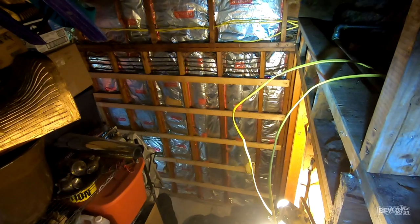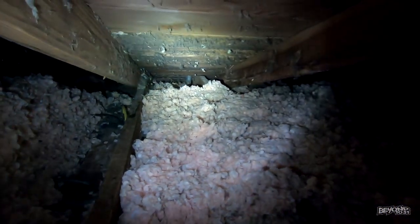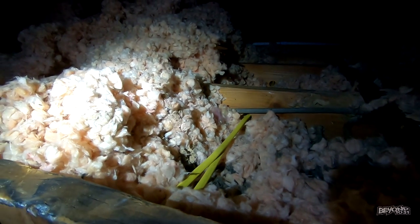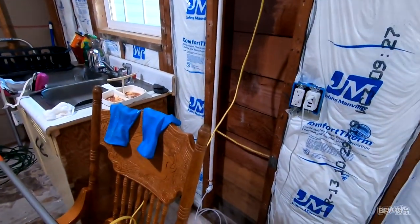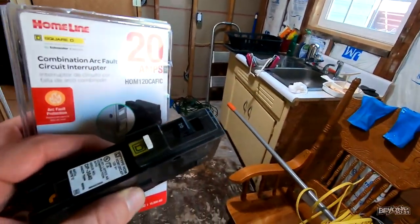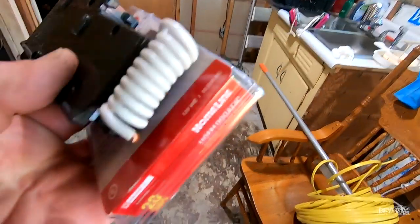So here we are just pulling cable. I had to get way into the peak over there. I know I said I wasn't going to film this, but look at that. Gross. Disgusting. Just pulling the cable. It seems like every clip I'm starting out with this view right here. So this right here is going to be the dishwasher. Any new circuitry that is added requires a combination arc fault interrupter. These are very expensive. You get a regular 20-amp circuit breaker for like $12 to $18. This thing right here is like almost $50 each.